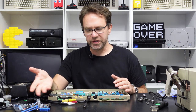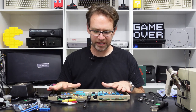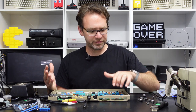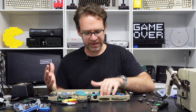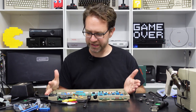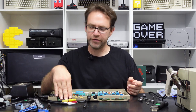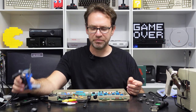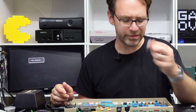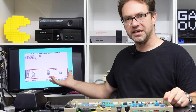If you don't opt for a harness you're just going to have to manually work out if everything works — that can be a little bit tricky because you need to confirm the user port works, the tape port works, the serial, and the paddle inputs for the joysticks. You can always start off with the dead test and diagnostic and build your own harness. Now let's remove the basic ROM and see what that looks like — exactly the same, because it's not booting into basic it doesn't care if the basic ROM is not installed.